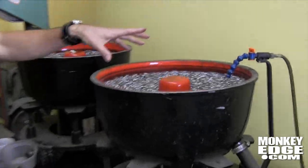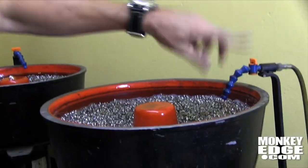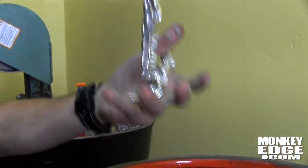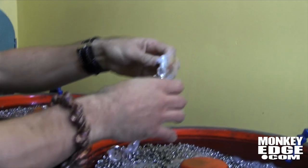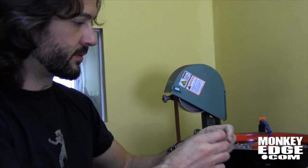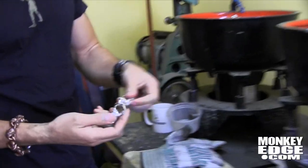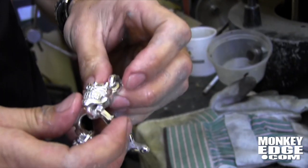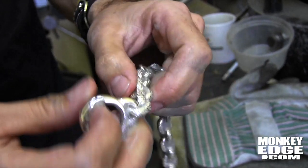This is kind of the final stage. This is one of our polishers running right now — vibrating tumblers with a soap and water mixture. This is our metal phase. There's a wall of chain here and I think I have a bracelet in here. I took a bunch of links out of the drawer, hammered them together, soldered all the joints, put the skull links on. The bracelet's now going through the phases of polishing — looking a little shinier, but it's still got some imperfections, BBs and parting lines that I'll clean up, and soldering lines I'll sand down.